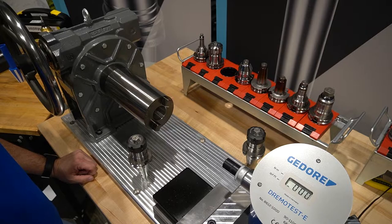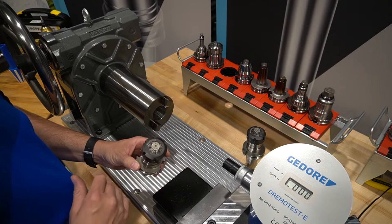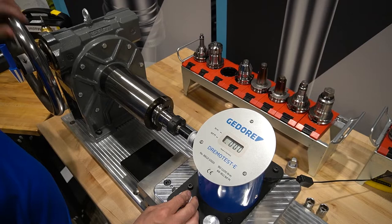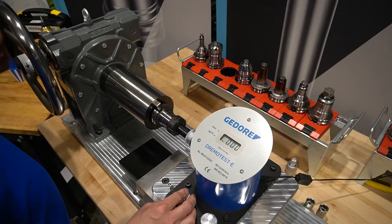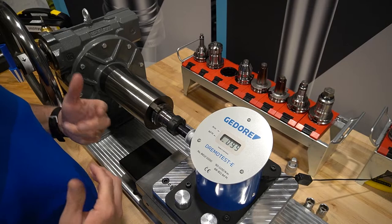We've moved over to our torque measuring device and let's measure our clean assembly first. Now this is about as clean as it can get — everything's been wiped down, torqued to 100 foot-pounds, and we have that half inch pin. This is the clean mark; this is our benchmark. We will compare the dirty collet assembly to this. Let's get this to engage with our torque meter and see how much force we have on this one. So 100 in, about 99 out — pretty much a one-to-one ratio, which is about what we would expect.